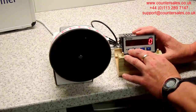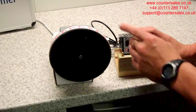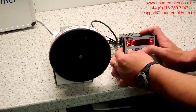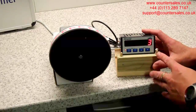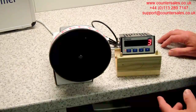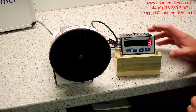We're going to go into the function codes by pressing the two buttons here — this is all explained in the manual — and we're going to go to function code number seven. We've already set it to number three; number three in the manual is for quadrature times one, and what this means is that when we turn the wheel on the encoder the counter will count up and count down. That's the main one you want to get set first.